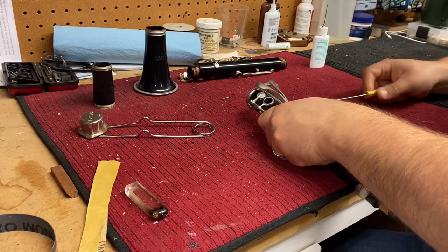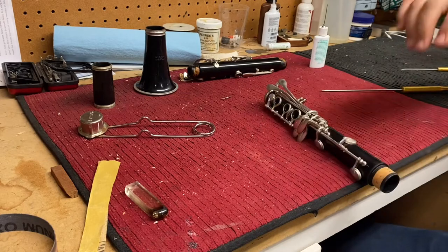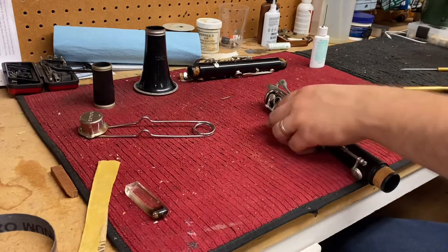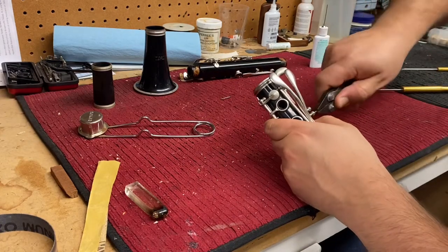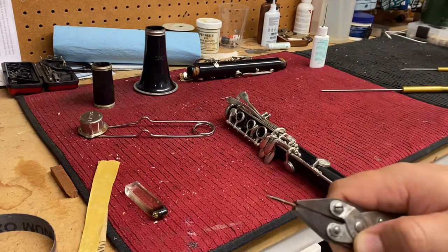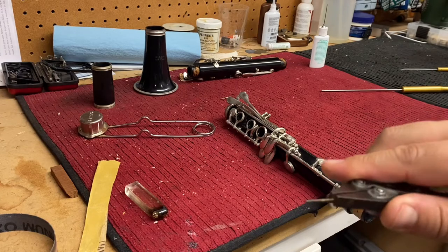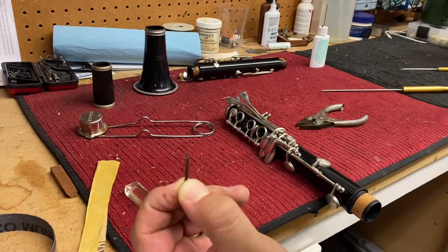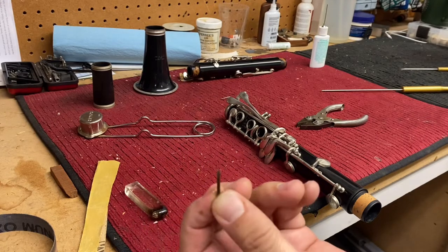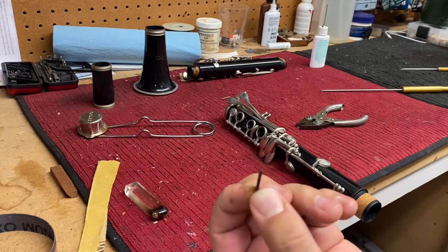There we go. A larger screwdriver seems to be doing it just a little better. This one though needs a set of parallel pliers to help grip it and pull it out. Look at that — it is just completely brown. Some of that is going to be the new oil that we added, but it goes to show you what it takes just to remove some of these guys sometimes. It's pretty chewed up. Heat, oil, and a big screwdriver that fits inside the head. I'm going to file this flat, recut it, and it will be good to go again.